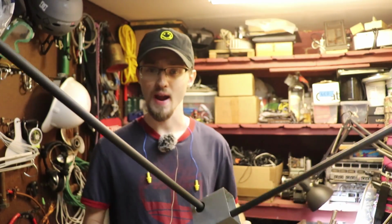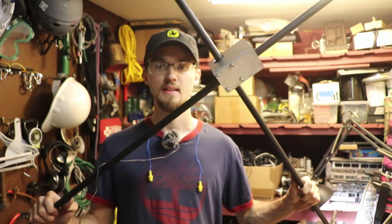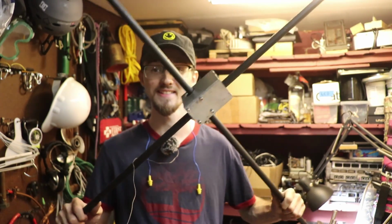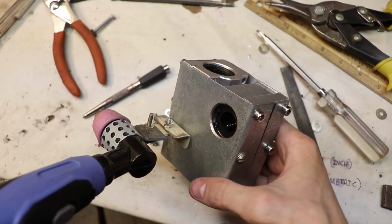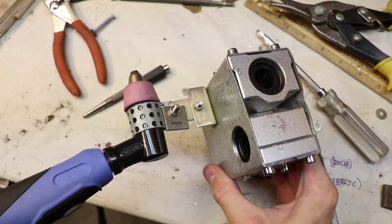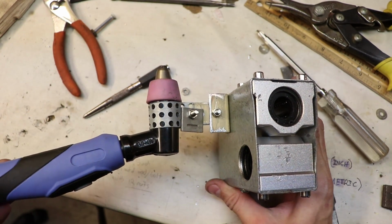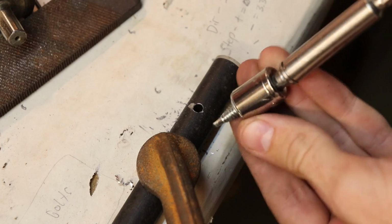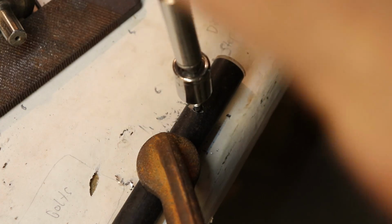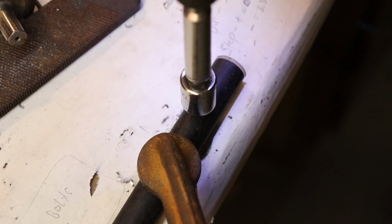Alright, well, I managed to finish the bracket, and yeah, it works pretty nicely. Here is a close-up of the whole assembly. You can see how I connected the linear bearings together, and also how I connected the plasma cutter head. I drilled some holes at the end of the tubing that will serve as connection points for the wires or belts. I used a self-tapping screw here, and that worked just fine.